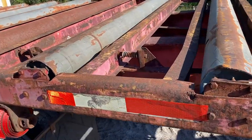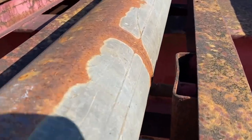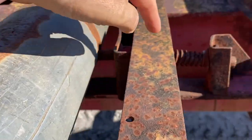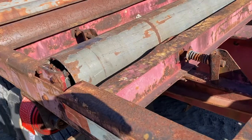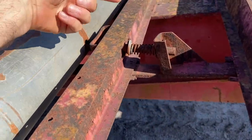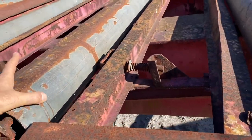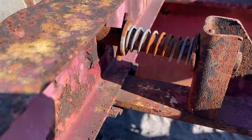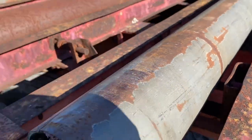For those of you who are techie heads, you can see that these rollers have a hole in them, and this peg is spring loaded and it locks the roller into position. When it's hydraulically released, this bar goes back so that the peg slides out of the roller so that it can roll. You can see this spring right here and you can see the peg is in the hole, locking it in.